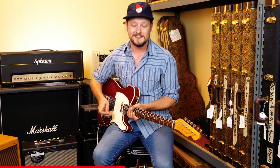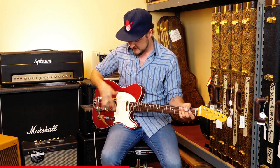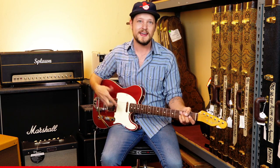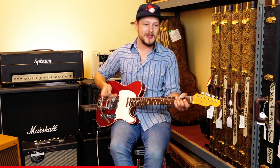A lot more high-end on the parallel. In series, you take away a lot of high-end. It's like running both pickups straight through — it has twice as much distance to go, kind of acts as a resistor, so it loses some high-end, just like a very long cable.